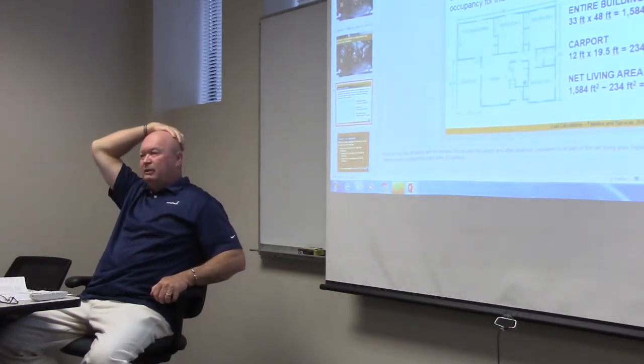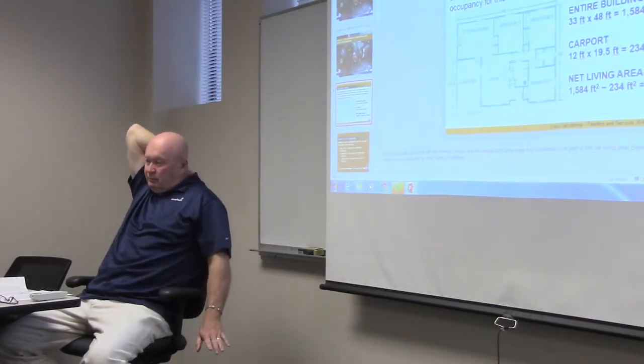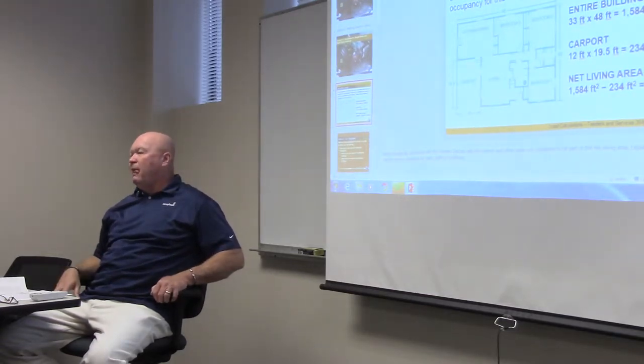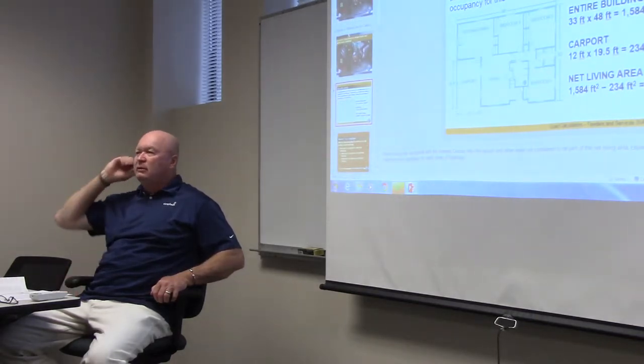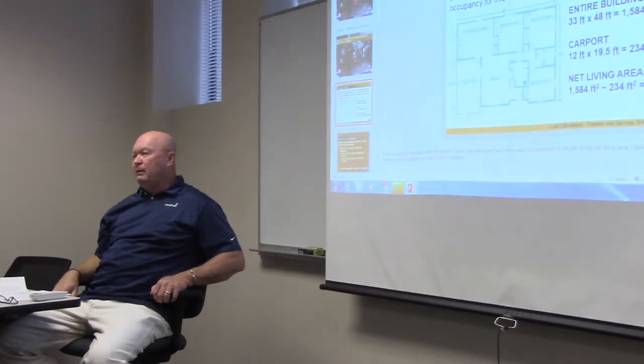Are y'all working off ladders out there? Yes. Most of them are working off 6 foot, like in the building we're in right now. So there's probably a few cases where you don't have to tie off. I guess if you're on the third rung or below? You actually can be on that fourth rung, and it's like 3 foot 10. As long as you don't get above the fourth rung. There's really only five rungs that you could actually stand on, so as long as you don't get on the last rung, you'd be okay. You're not even supposed to be on that fifth one anyway, because of being top heavy.